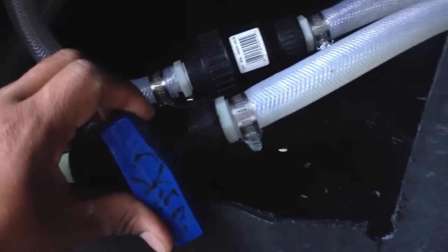I have a separate chemical line here which goes back to my chemical tank. And then this is actually my water switch, so I can switch the water off and on. There's a T-system right there that runs up to the pump. Just because of the way it sets, I do get a kink here. I actually found some suction hose — it's still a polybraid hose, but it has a coil inside the tube, and it's specially designed for applications where just a small amount of pressure is put on it, so the hose doesn't collapse.